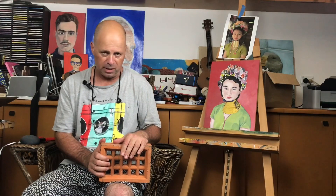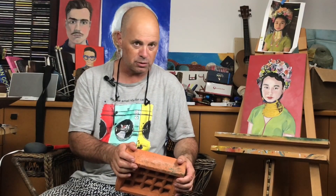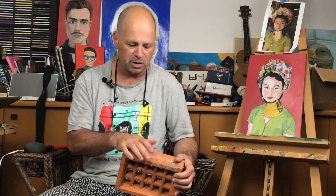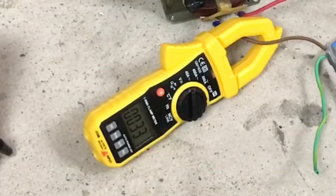I was told I need a ceramic former for the nichrome wire load — it obviously gets very hot. Necessity is the mother of invention: I found an old clay grate and wound the nichrome wire through it. This provides a number of different load options and I'll keep it at the back of the shed for future load tests. The key question was: connecting the primaries in series — does it lower that nasty idle current? With this wired up, we have an idle current of 330 milliamps.